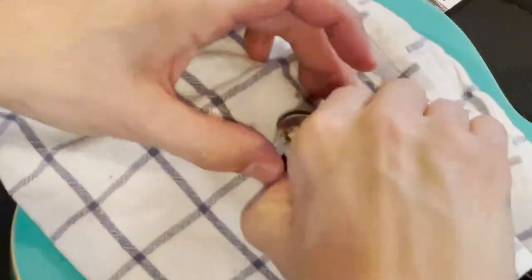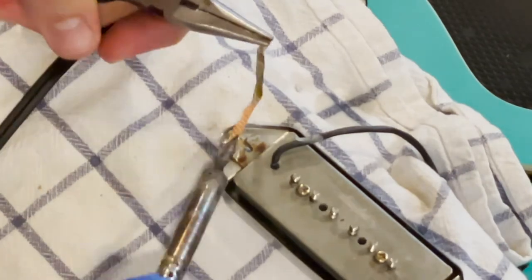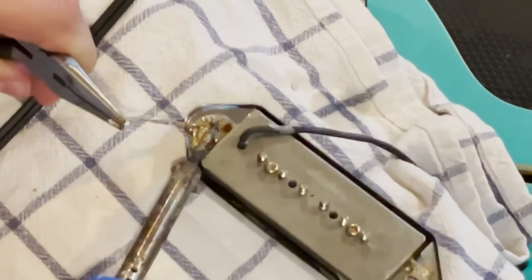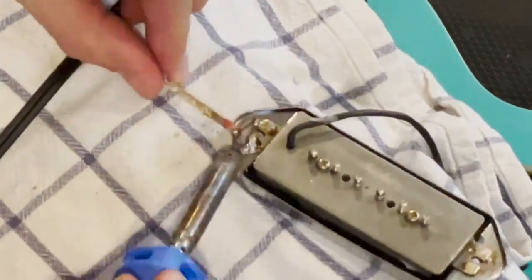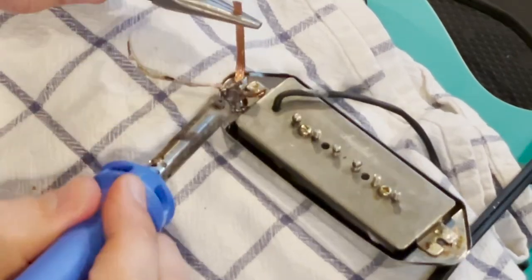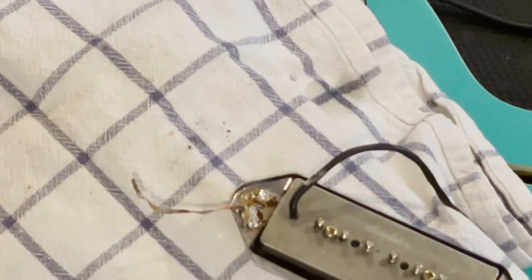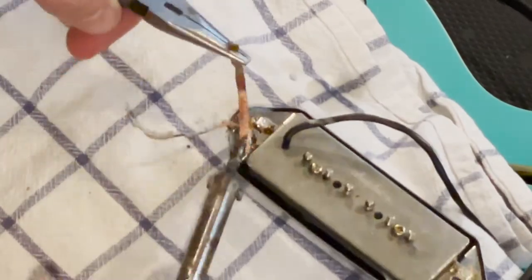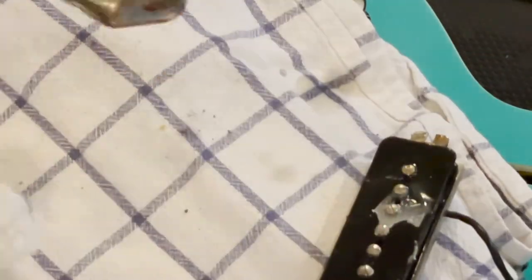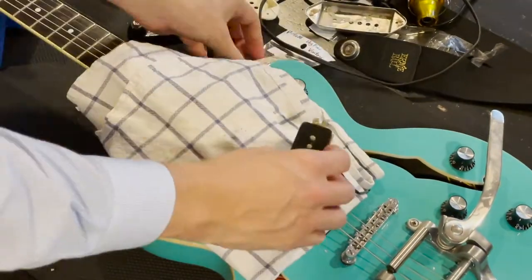This one seemed to have less corrosion — this is a 20-year-old guitar at this point — and it was much more cooperative. I was able to get it off. The theme is that you just need a hot soldering iron. I spent some time filing down the tip because in the course of doing this it gets corrosion or oxidation on there. I soldered the braid to it and couldn't get it off again. I tried rubbing some flux around the outside, thinking that if I could melt any of the solder it would flow away. I got lucky and was able to get that off. You can see the wax that's in there — you can just scrape it off your finger.